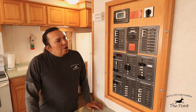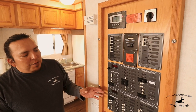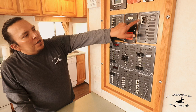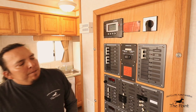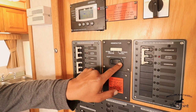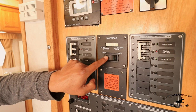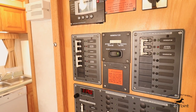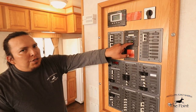Once you've done that, begin at the panel. Make sure a few switches are in the off position: your air conditioning compressor and conditioner need to be in the off position, and generator switch one and generator switch two both need to be in the off position as well. With your start and stop switch for the generator, activate the stop side and press and hold for five seconds. After doing so, press and release on the start side — you don't need to hold, just press and release. Listen for the generator to fire up and continue running, or look at your green indicator light — it should be illuminated when the generator is on and operating.